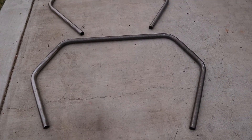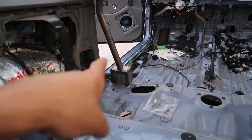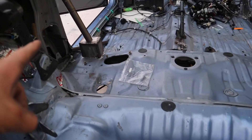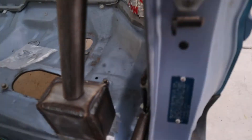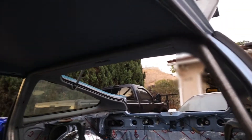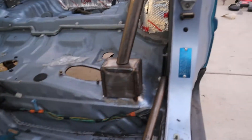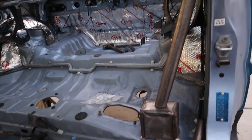Second time around I was like, oh, I figured it out — but this one came out short. All set in place, mounting blocks are set. So there we go — made out of 3/16ths cold rolled steel. Here's the tube, box number one, box number two, up and around, hugs everything real nicely. The bends are exactly where I want them to be, and back down. All in one continuous fluid motion. I'm pretty happy with it.